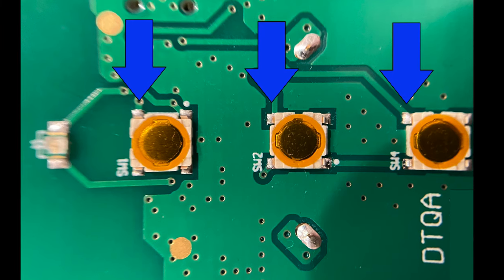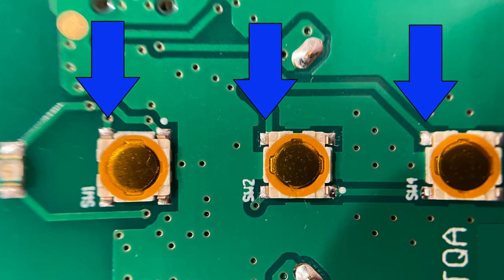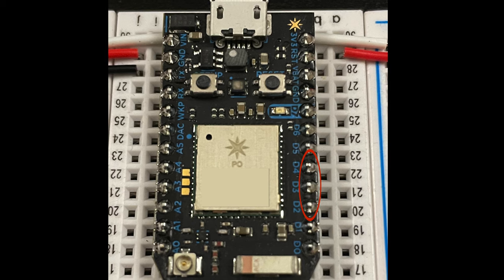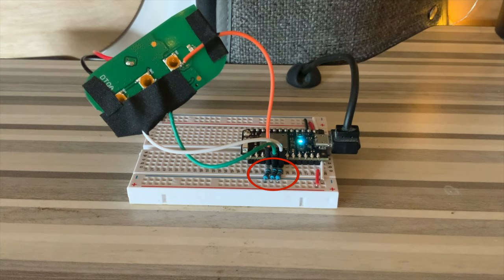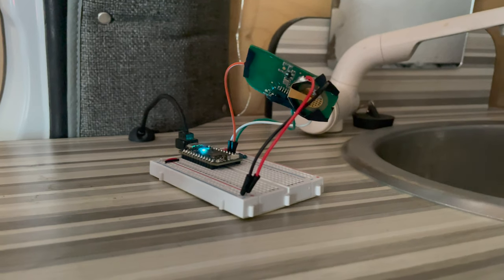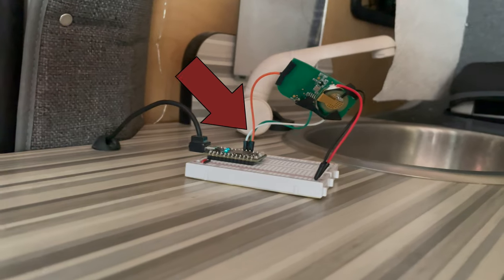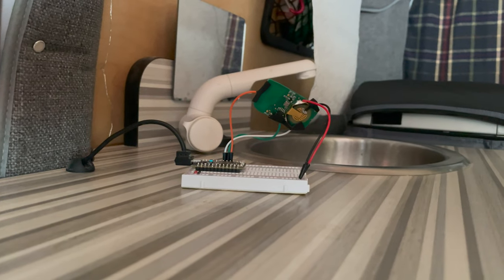This is the other side of the board. I did some testing and found that applying 3.3 volts digital out from the Particle board would be enough to trigger these buttons. On the microcontroller side, I'm using pins 2 through 4 as digital out. Be sure to also connect these pins to ground through a resistor — you don't want these inputs to be left floating if the microcontroller is off. Once you connect all the wires up, you should have something that looks like this. You'll see I have power and ground going to the 5-volt source, and each of the pins connected to one of the digital outs I mentioned. In the future I'm probably going to make this a little bit cleaner, but for prototyping this is fine.